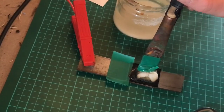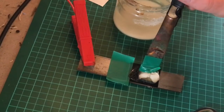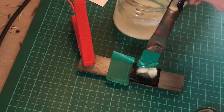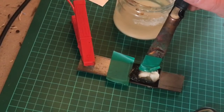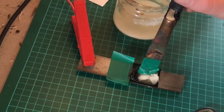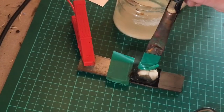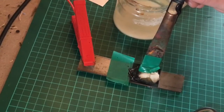I've personally done it on stainless steel and steel. I hear it works on aluminium and all sorts of things. Keep working over the area depending on how deep you want it. If you just wanted a light etch it's probably already deep enough, but always go over to make sure — because if you take it off there's no going back. There's no saying 'I wish I'd had it deeper.' They always look better deeper, take my word for it. Take your time and make sure it goes nice and deep.